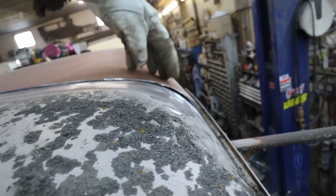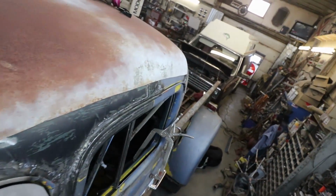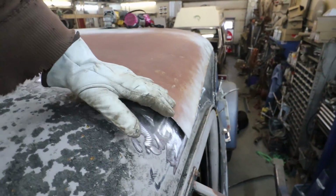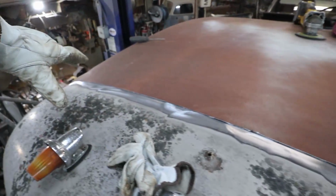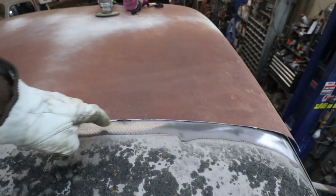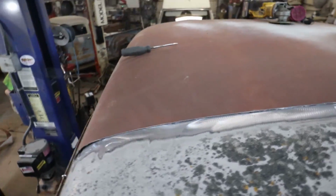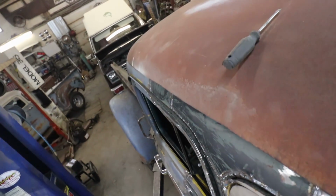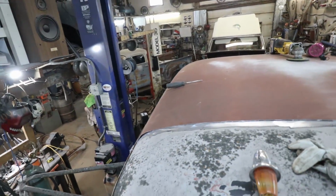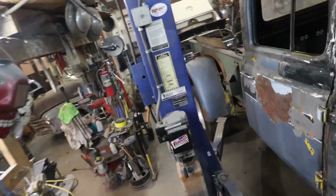You know, we have to do a little bit of push and pull, but it covers up most of the sides. So at least now, when this gets welded in, I only have to do body work here on this lip, and I'll do a little bit up here, but it won't be crazy. I'll do the old cut and butt weld, so you go slowly. It shouldn't warp or do anything weird. Should stay nice. Same with this side. It's all nice. The back isn't 100%, and I'll show you that in a second here.